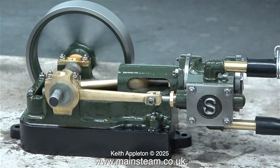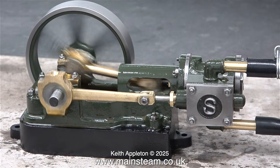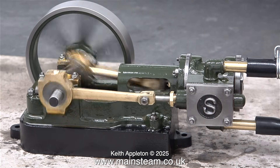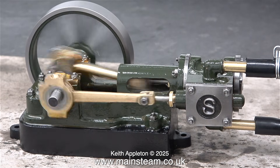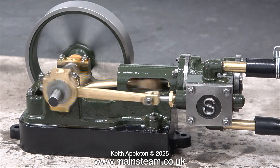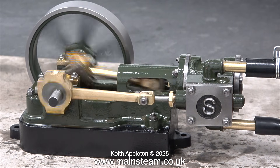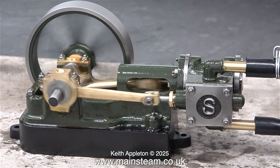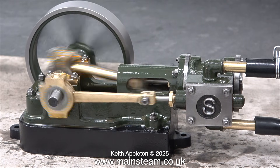But I'm really pleased. Watching this engine develop from a box of rusty parts to this in quite a short time has been quite an interesting experience. The strange noise you're about to hear is me using the live steam injector to pump some more water into the boiler. It's definitely a bit touchy — I think I'm going to fit a number 4, which is a larger capacity injector. Eventually I got the injector to work okay and it filled the boiler.